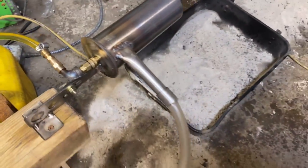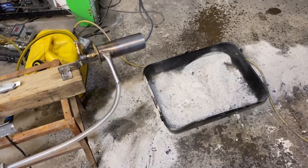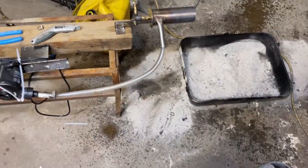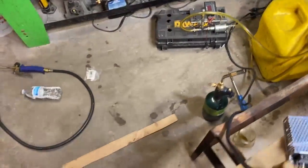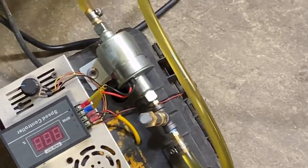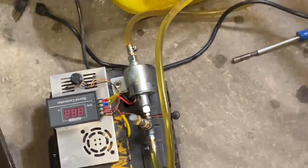It did have a little bit of a leak in the back end here that we can fix up, but this is all just a test. What we're trying to do is get away from needing an air compressor for a boiler burner that I'm building, and I want to be able to do this without high pressure pumps and expensive equipment. That's a $20 fuel pump that should be durable enough — if it's made for a car, typically they're durable enough to run for a long time.